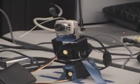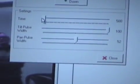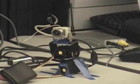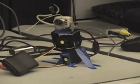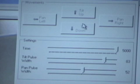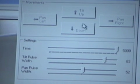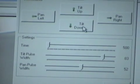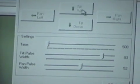This little slider here is there to control the time — it's in milliseconds. If we slide this all the way up, it's really slow. It'll take 5 seconds to move the servo no matter how far it has to move. The pulse width here is just for how much you want to move it each time.